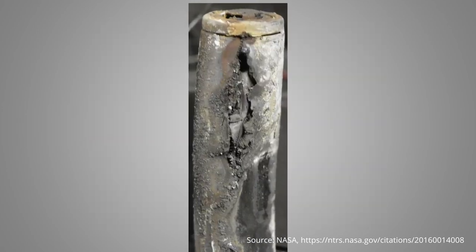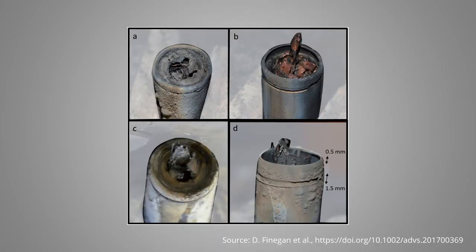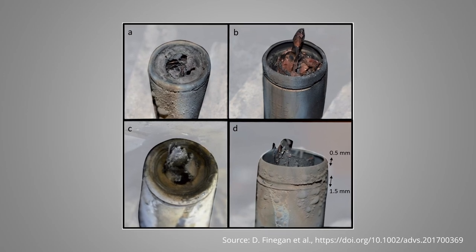What the NASA study found is that the occurrence of sidewall ruptures and decrimping of the top cap is reduced, but not completely eliminated in all cases. It strongly depends on the root cause of the thermal runaway as well as the specific pack design. So this has to be investigated in specific pack designs and failure modes if you need a quantitative evaluation of the effectiveness of the bottom vent. In general, the bottom vent is a comparably easy method to increase the safety of a cylindrical cell, which effectively reduces the risk of an uncontrolled breach of the cell housing.